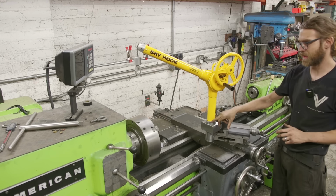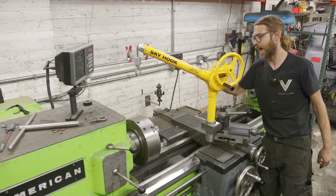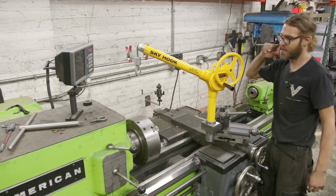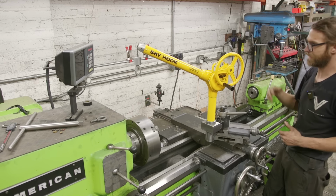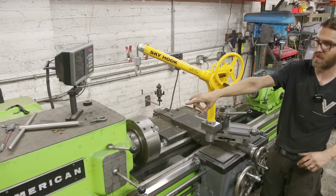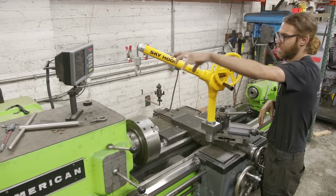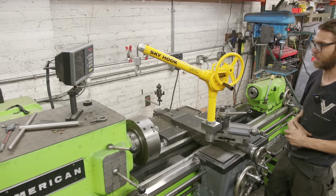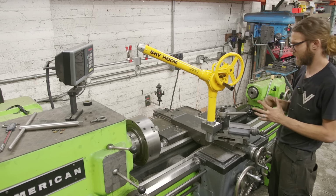And I've already experimented. You can actually put a dog bone in this and I can reach to the back and pick up stuff back there. Like for a minute I had the four jaw chuck sitting back there. I can pick it up, I can do all sorts of things. If I need to and I wanna service the lid, I can bring this close and lift off the lid and get in there as well, because that lid's like 80 pounds. So it's really, really nice.